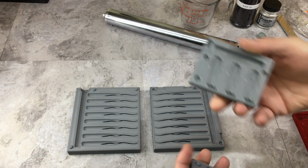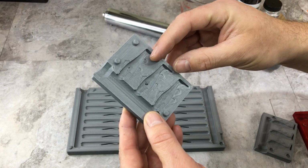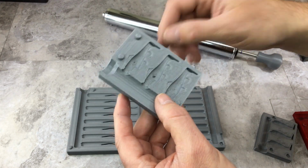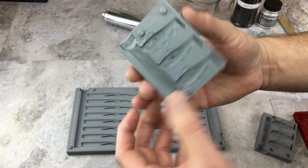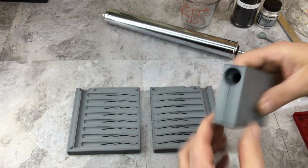Another one I screwed up before was a tiny mold. I used way too much pressure because it only uses a tiny amount of plastic to fill this thing, and I wasn't thinking and pushed a little too hard, and it blew through on pretty much the crown of the mold there, which might not have been as thick. But again, shot this one 10 times too, no problems. Once you fill that up with plastic, it pretty much seals it up anyway. So fortunately, I kept using those.